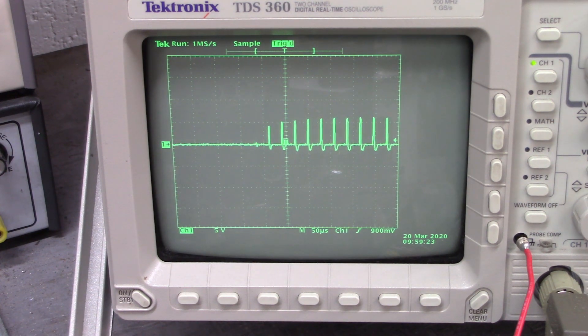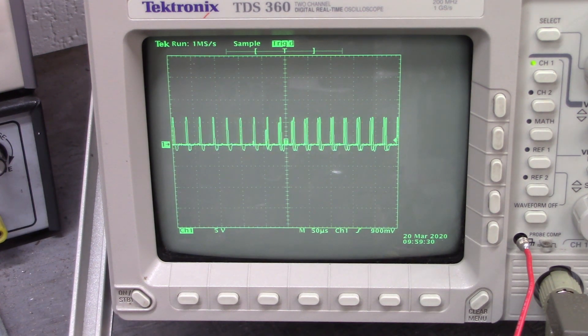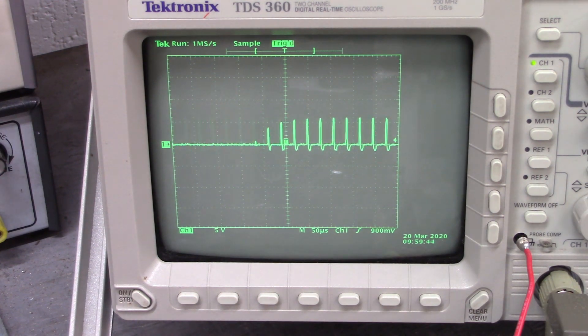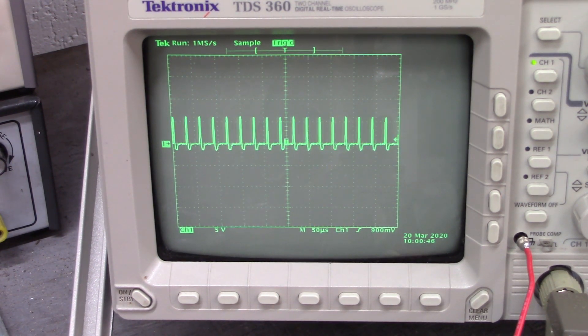The hard part is going to be repairing the SCR heat sink assemblies — they have the shorted SCRs. This soft start caught fire. I'll put pictures up at the end of the video so you can see the damage. It's horrible. Wish us luck getting that part back together. Work's never done around here. Let me stop the output by opening the start switch. There we go — that part's fixed.